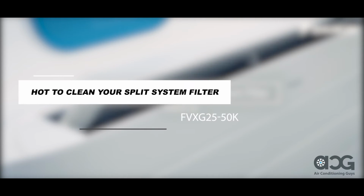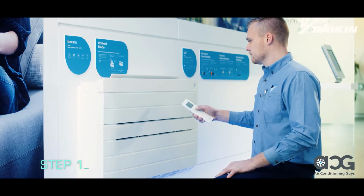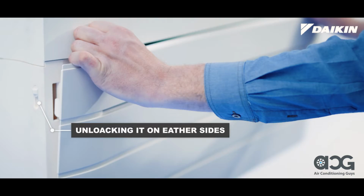Cleaning your Daikin Nexura split system filter is easy. It takes less than 5 minutes, and all you need is lukewarm water. The first step is to turn your unit off using your controller. Once the louvers are closed, open the front panel by unlocking it on either side of the unit.